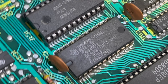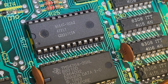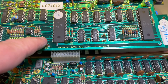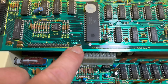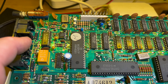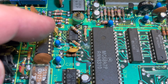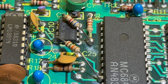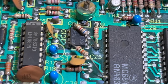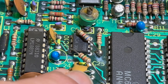In the original machine I was working on we've got a Texas Instruments chip and a no-name chip. I've just noticed something different - even though these are both Mark 2 Issue 5 boards, the second one I'm working on has these bodge resistors off the VDG video display processor.